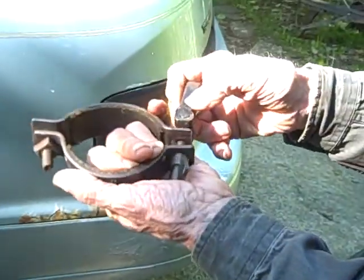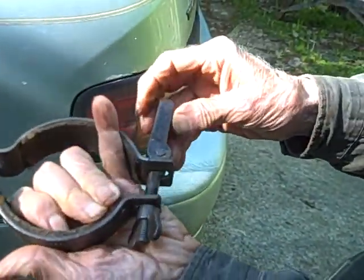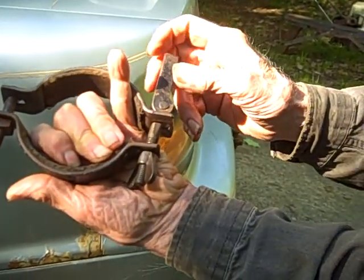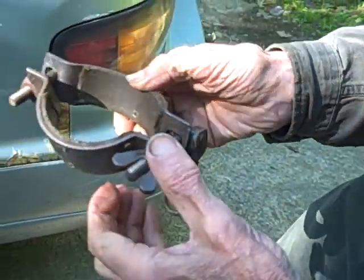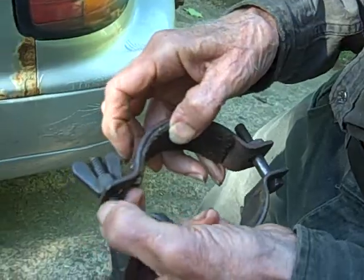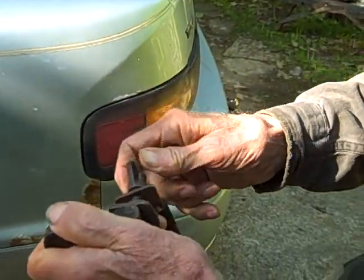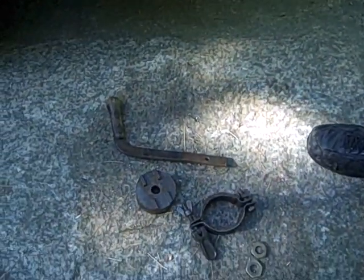This cam is interesting — you see how there's a flat ground on there? That's what does it. You can actually see the thing move about a sixteenth of an inch, and that's enough to lock it down. Nice Mickey Mouse ears on that wing nut. Of course you can't use an ordinary wing nut because of the angle — you've got to have enough space that you can turn it. And you can adjust that when you're running the boat; if it starts to loosen up, you can do that without having to get your toolbox out.